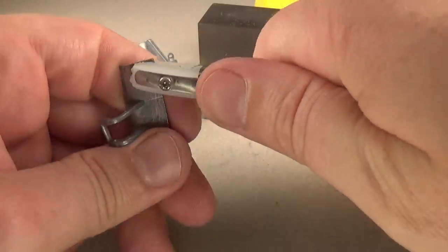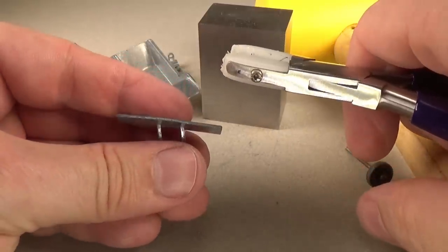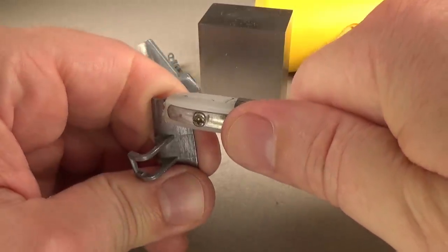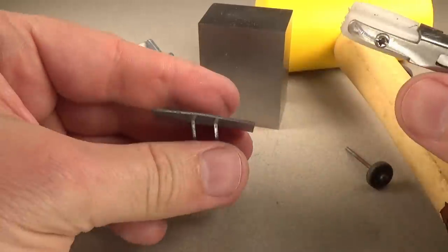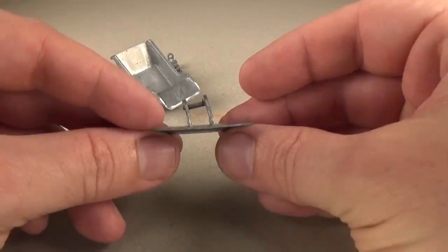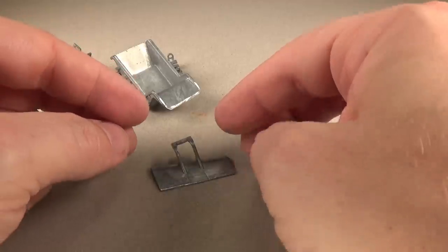Diecast sort of work hardens. If you bend it one way, you're fine, but attempting to bend it back usually ends up with a broken part. Right before that happens, though, the part usually gives you a lot more resistance than before. This is your cue to stop, because if you push on, you'll just break the part. That's why I couldn't get all the bend out. I was getting more resistance and felt a break was on the way.